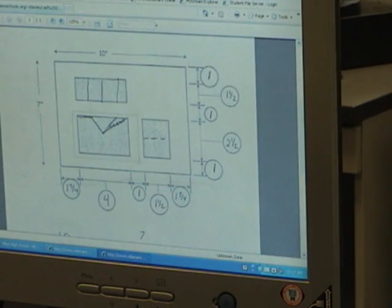Our front view, we're going to see where the V-block is, and our right side view, you'll have a hidden line action here. So we get the measurements to fill out our cheat sheet. It's 1.5 inches wide. It's 2.5 inches tall. The 1 inch that I have is the given number that I give you. 1 inch is between the views. Same with this one. It's 4 inches wide. The 1 inch is between the views, and then once again it is 1.5 inches wide.